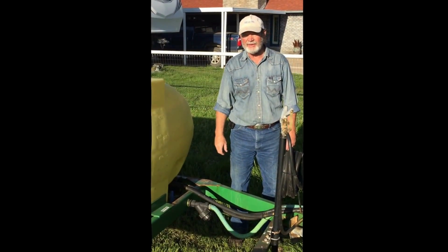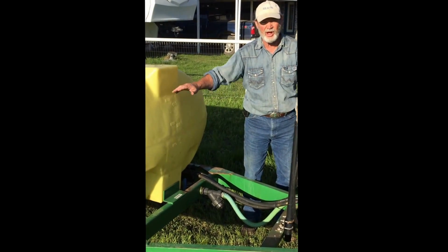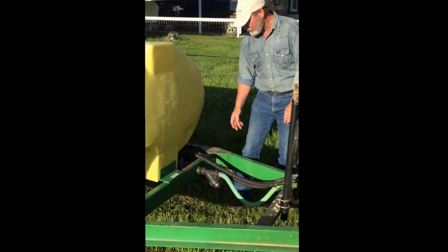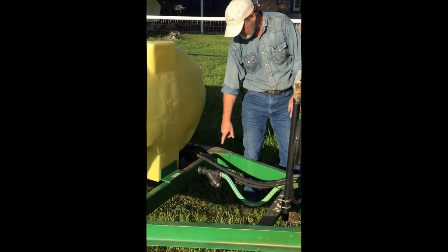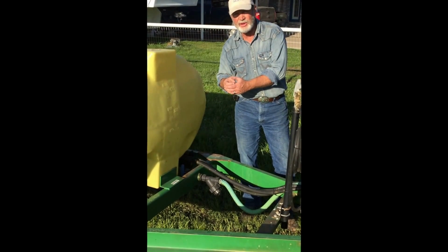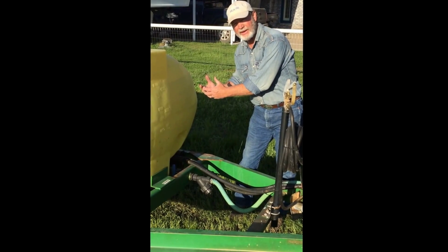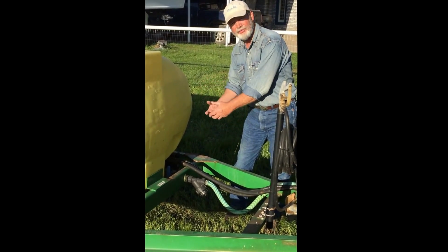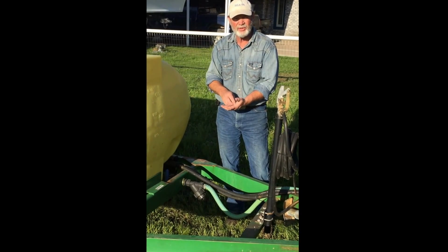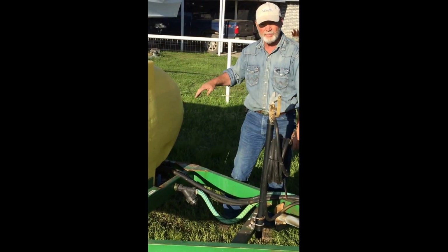All right, we're now in the field. We're going to spray. We've done a little bit of dry getting here, had some slosh in the tank. Notice my flow is still off. What I'm going to do is put that off. I'm going to remove my filter. If I turn that on, there's going to be a small stream. And I'm going to let that stream run until I get a full flow. And then I'll get a flush. And I'll lose about maybe a palm full of sea mineral. Shut that off, put my filter on, I'll spray my 20 acres out with no problem.